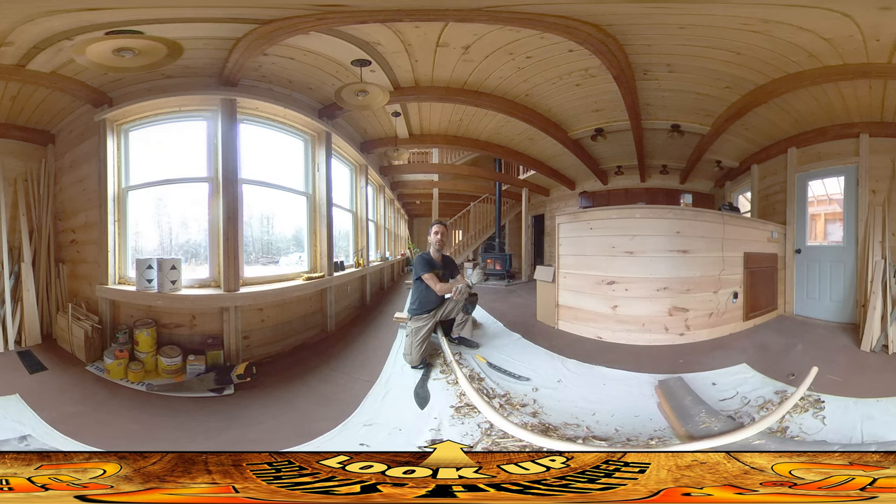Also in the not-so-great news category, there's a leak in the pantry area coming out around the three-inch ABS conduit that runs from this house into the root cellar. I can run power through there to run lights or a dehumidifier, and if it was ever used as a fallout shelter you could put a water line through there too. It's leaking not from within the conduit - the inside is dry - it's leaking around it at the seal from the foundation, which is surprising because it's been there a long time. I think it's because I just put in those eight-foot grounding spikes. They were going through some cavities in there, and I think when I pushed one through I made a highway for water to spill in, filling one of those cavities and working its way around to that area.